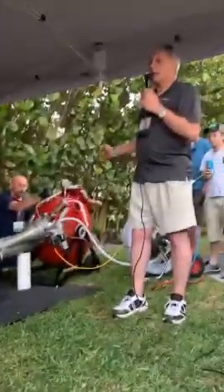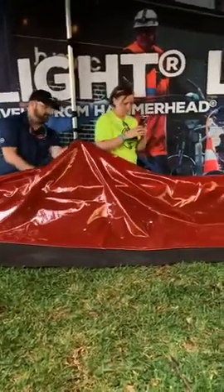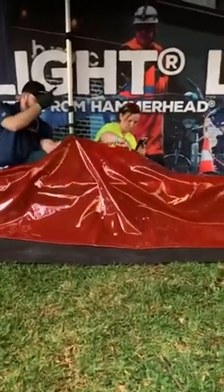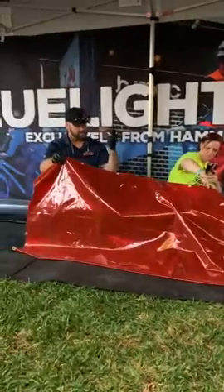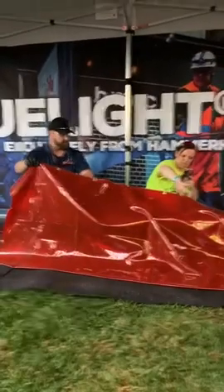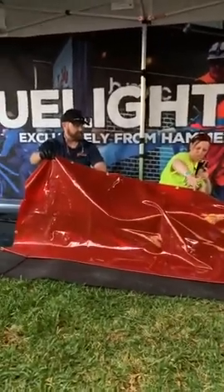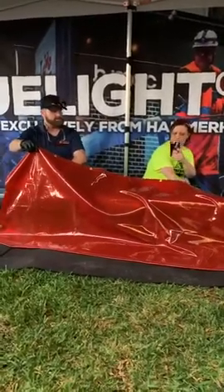Because it doesn't cure with ambient light, if you have an issue trying to blow it around 90s or 45s, you don't have to worry about losing that liner or that resin getting stuck. You've got all the time in the world. If something happens, you can go make yourself a pot of coffee, drink it, get it fixed, and then continue on. It will not cure until it sees that light.